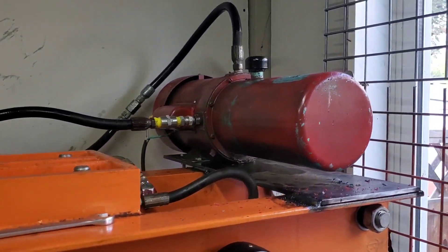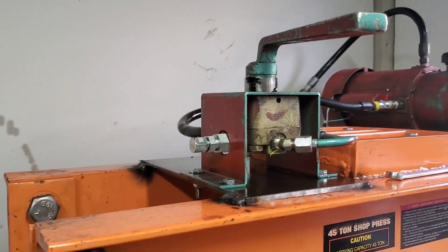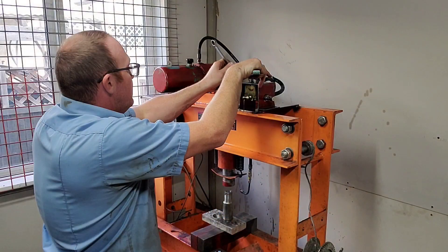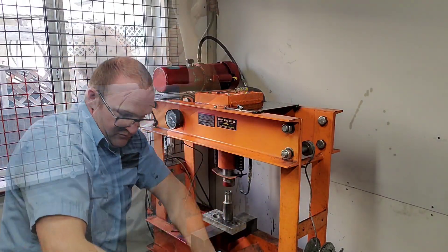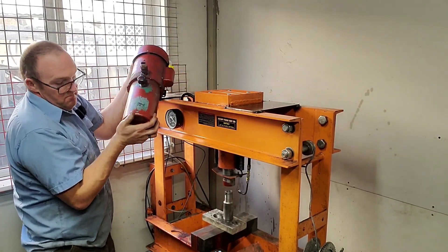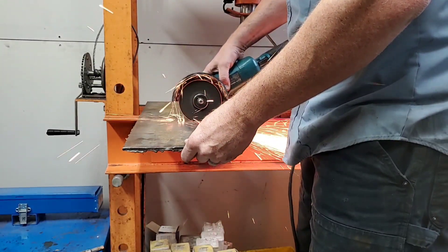So originally I had planned this great video with all of these hoses and diagrams, but don't worry it's going to work in the end — we are going to crush some stuff and we do reach 45 tons. But first we have to remove what I did. The whole set of hoses and valves did work, except the failing point was the hydraulic pump only went up to 2,000 PSI when I actually needed it to go closer to 5,000 or 10,000.